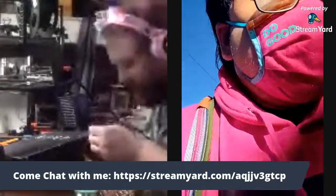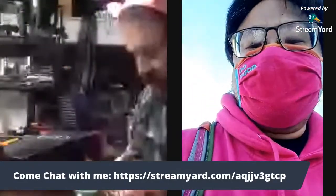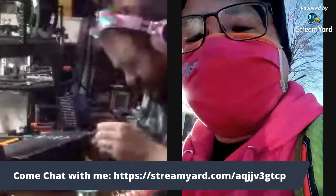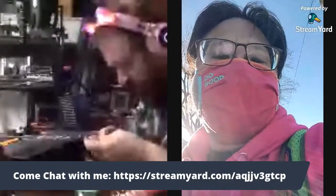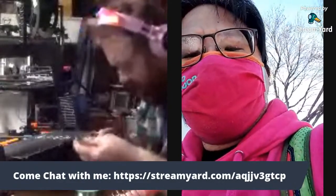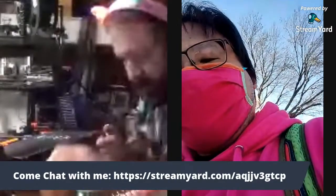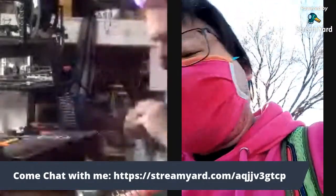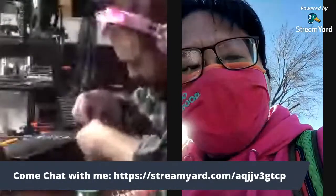Okay. Well, let's see. I'm gonna solder this whole damn terminal on and see if that works. If not, we'll just replace the whole part. I probably would replace the whole part if I had a spare in stock for this heat bed. And I have different heat beds, which I guess would work, but I think most of them are 12 volts. This is a 24 volt. So. Yeah. Okay. What's the size of the bed? Those are 16 by 16 inch, or? No. This is 9 by 9, something like that.